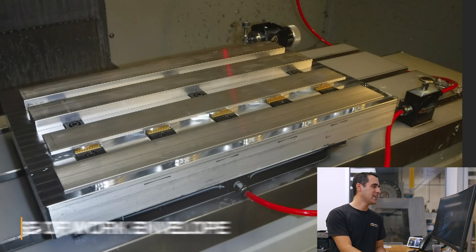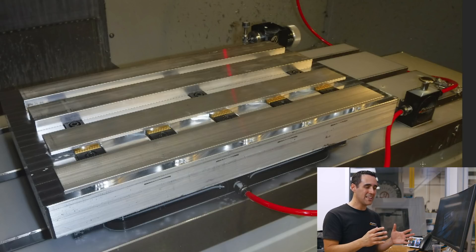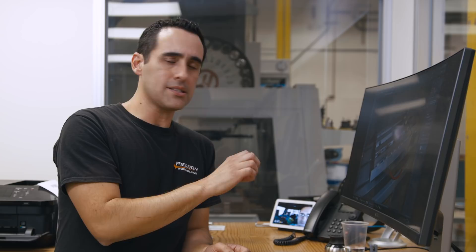Finally, taking a look at that second photo is the use of his work envelope. If you've got a machine that can hold our large pallets, definitely do it. The only time you want to go smaller is if the weight of the fixture is a concern. Out of the box, unmachined, our 10 by 16 inch pallets are 24 pounds. If you have lots of pockets and light aluminum parts, the weight's not really going to be an issue. The mini mill here is a relatively small machine, so leaning in isn't that big of an issue. If you're loading something like a VF5 or above or a bigger Doosan mill, you don't want to be leaning in with that much weight. But Jason definitely used the work envelope to perfection.